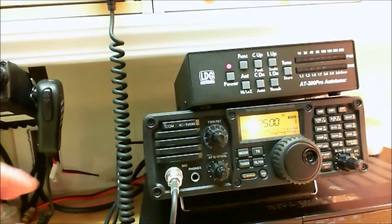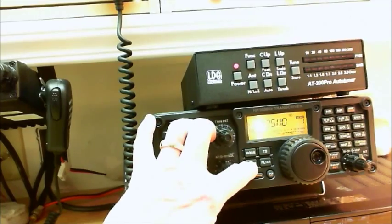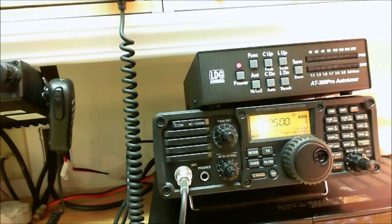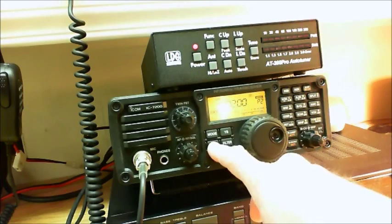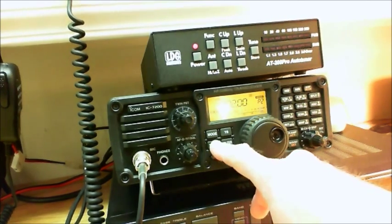We're going to go ahead and place the tuner in tune mode here, and I think you could hear that little response from the ATOM. Let's try tuning now. We'll go back out of tune mode and into tune mode, and then the LDG should start tuning, and you should hear the ATOM make progressively changing tones — starting with a low tone in the beginning, and then hearing higher and higher tones as the LDG tries to tune, but can't quite make it. So, here we go.